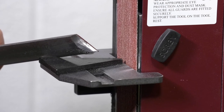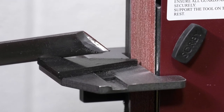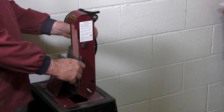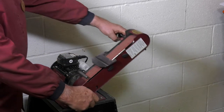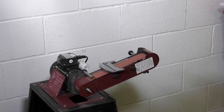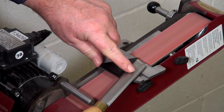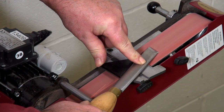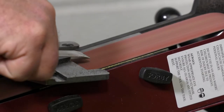Now you have your guide to where you need to sharpen and how much needs to be removed to give a sharp edge. Set the tool platform to 15 degrees as stated on the angle setter information at the front of the machine. For comfort, lay the belt assembly down. Rest the tool against the jig and with your hand on the blade and in line with the tool you have greater control. Keep your finger in the middle of the shaft to limit any rocking motion, which would cause problems when sharpening this tool.